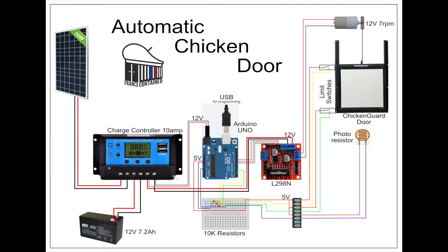Just one point to take note: it is best practice to connect the battery at all times before the solar panel. Also, vice versa, disconnect the solar before disconnecting the battery. So basically you're not having the charge controller running with just the solar panel connected.